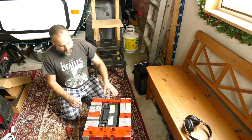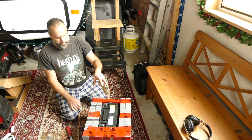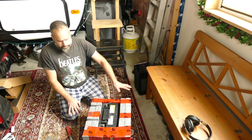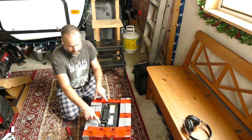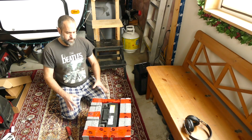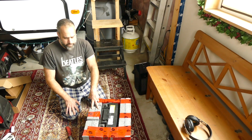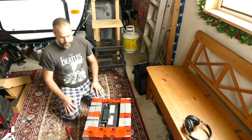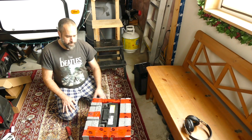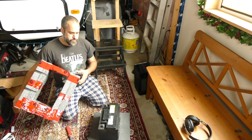This little opening will allow the hydrogen gas, I think it's hydrogen, that is produced in the course of the battery doing its thing and charging, to vent off. Also, I need these two ports to run the cables out to go to the charge controller. So the idea is that in the winter, we'll bundle it up like this. That's two layers of the R10 hard foam, so it'll be R20. I'll have two layers underneath, two layers on each side. I need one more for here. Cap it, be done with it, and then in the summer, just pop that off and put it into storage and just leave the battery out.